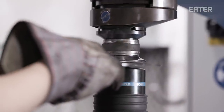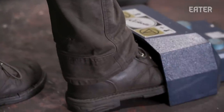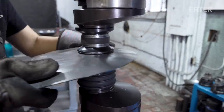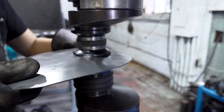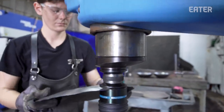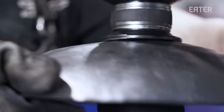The head goes up and down the same amount, and we can open and close that gap with the foot control, so as it's pulsing you're able to get really precise control. Specifically with the wok, the cold process we do is bending that metal. Starting with a flat disc, I really want to move in a symmetrical pattern. From there I'm making quick judgments with every single strike of the hammer to manipulate it and move it where I want it.